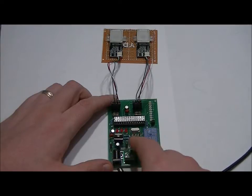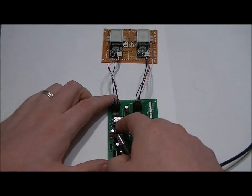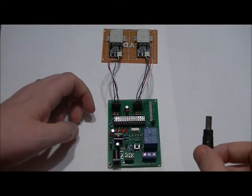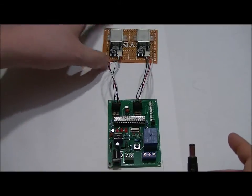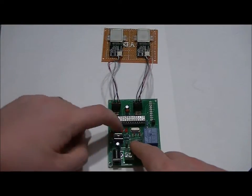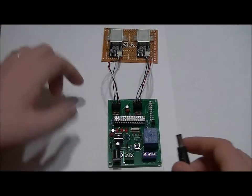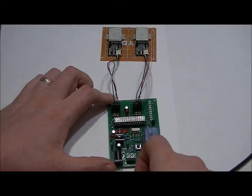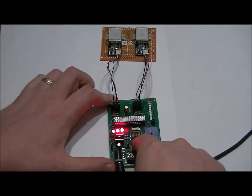I'm going to hold down the cell button. The PG LED will light up, and the LE LED will light up, and if I let go after that, then this fingerprint scanner will turn on, which means we're programming the left. If I continue holding on to that, the LED turns off and the RI LED turns on, and then I let go and this fingerprint scanner will turn on. So I'm going to program in this one. So I'm going to hold down the cell button, plug it in, middle and left, keep holding it, middle and right, let go.